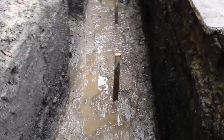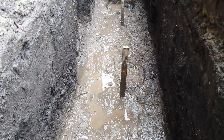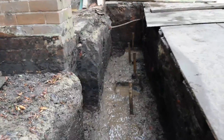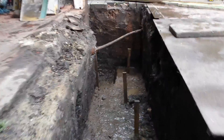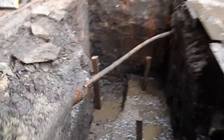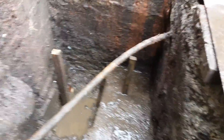It's going to be a good thick concrete foundation here — probably about 18 inches — strong enough to build a double storey even though it's a single storey. And if you come across something like electricity cables, you'd always better put in either a rainwater pipe around it or wrap it in.